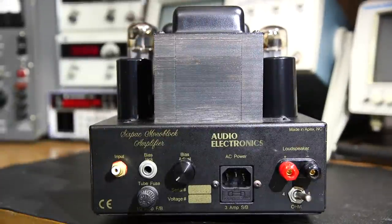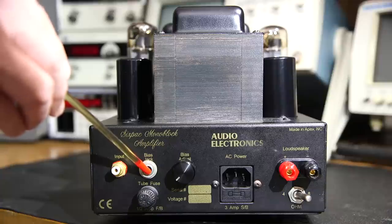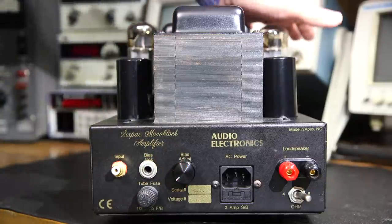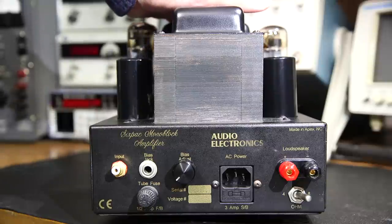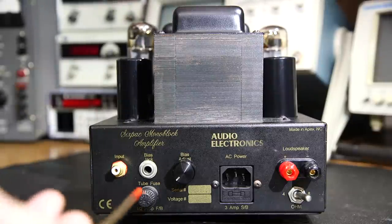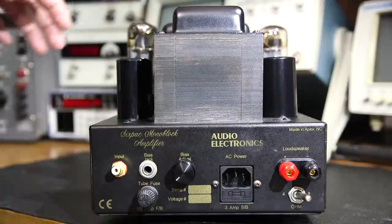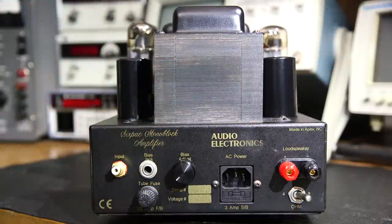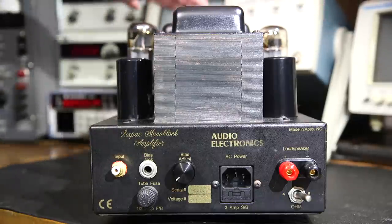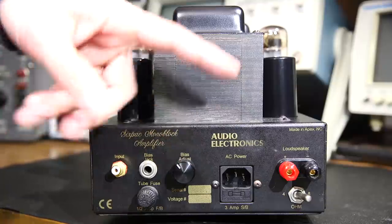This is the backside of one of these six-pack monoblock amplifiers. This is the audio input jack — a standard RCA type jack. This quarter-inch jack here is used in conjunction with this control to set the cathode current to all of the EL34 tubes. In order to set the bias on one of these amplifiers you need some form of external current meter. That external current meter gets plugged into this jack, which has a switch inside. That switch opens and disconnects the cathodes of all these EL34s from the chassis, routing the cathodes through your current meter and back to the chassis. That allows you to read the cathode current of all the EL34s. To adjust the bias, you slowly advance this control to the desired cathode current — for this amplifier they specify 220 to 230 milliamps.